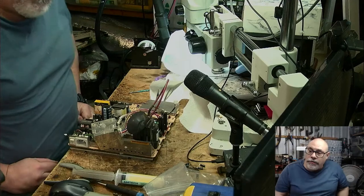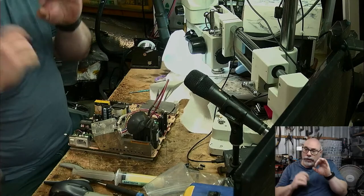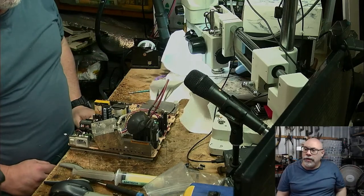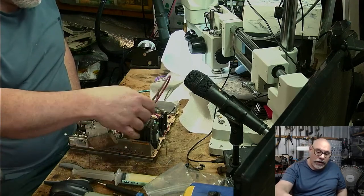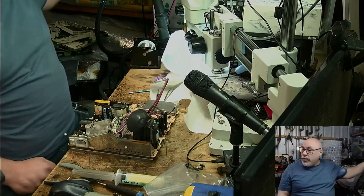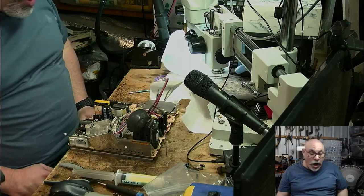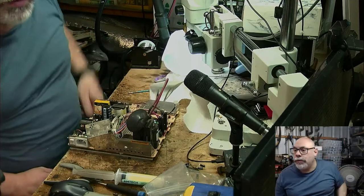I guess the one advantage is that those flybacks, certainly the later ones, the Pluses, the little tiny flyback that was on the original 128K, the thin one, they do have a fairly high failure rate. But the ones on the Pluses and SEs and that, I have generally not had any of them go bad. I know they do, but I haven't had to find any. I've got a couple of spares on old analog boards here if I do need them. But in terms of finding a new one, no. If anyone does have a supply source for those, it would be great.